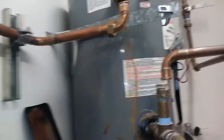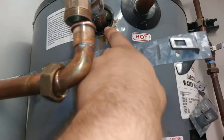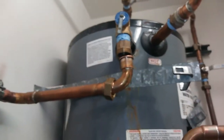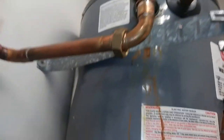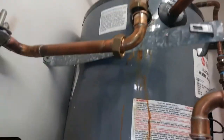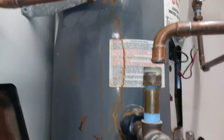This is a 15-gallon water heater we're replacing. There was a little leak at the tank connection where the relief valve taps in — it was apparently cracked. We thought we could just pull it out, re-dope it, and re-tighten it, but after we did that it was gushing water, so it was definitely cracked. Anyway, we're going to be replacing it.